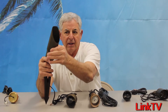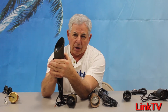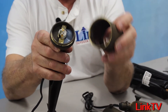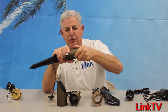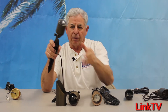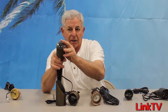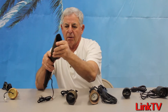Along the same lines is a trombone shroud fixture. It gives you a lot more adjustment — you can position the shroud, take it off completely, and positioning is much easier. If the viewing angle needs a little more shrouding to the right or left, you can do that. Another benefit is that it's CNC threaded with a captive O-ring seal. That means once you screw this down, that O-ring is locked in. It's a little more difficult because you've got to put the lamp in, screw this on, and then position the shroud. But once you put this lid on it, it becomes a sealed chamber, which some guys really like — it keeps the bulb free of debris, moisture, and anything else. We call that the trombone-style fixture.